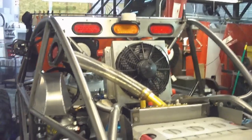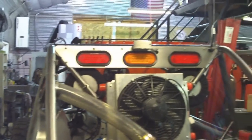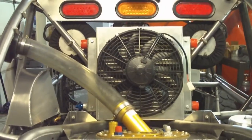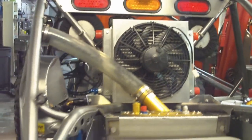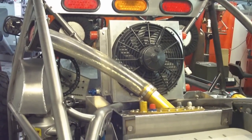Let me move on to the back here. Most of the stuff is actually in the back, so maybe I should have started there. We got the light bar in the back with brake lights and all — again, that's new rules so we had to do that. There's the new tranny cooler, just continuing on with the cooling theme. We definitely upgraded that quite a bit — got a fan on it now, put it up higher and out of the way to get some more airflow on that.